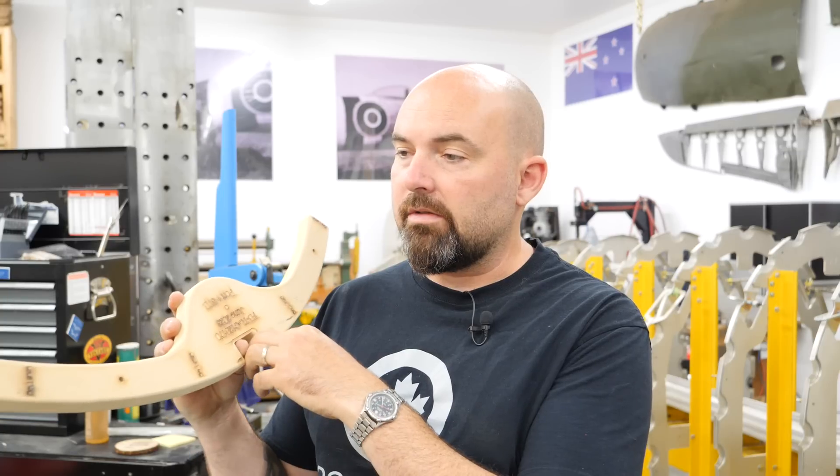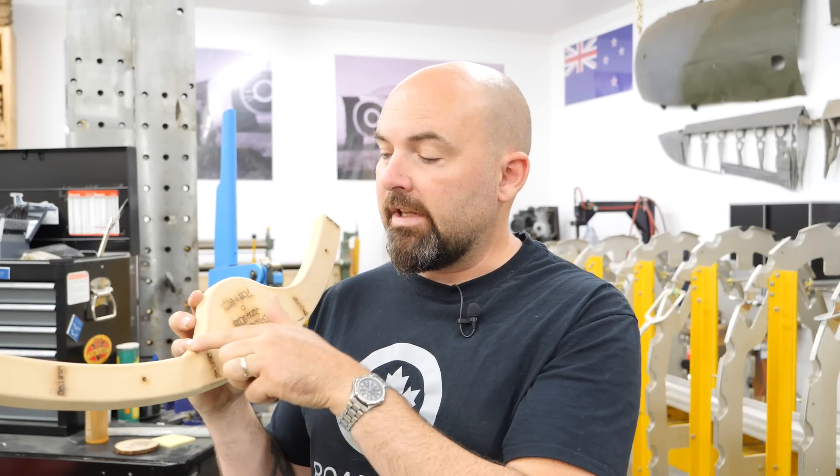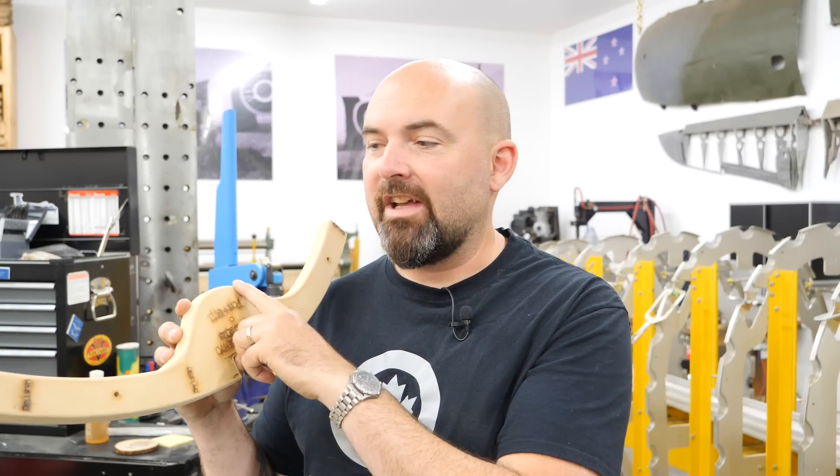In this case, because of the interesting shape, you end up with an outside shrink flange — pretty straightforward — then an inside stretch flange, but then when it comes back around you have a shrink flange too. So on this component it goes stretching, then shrink, shrink, a lot of shrink, and then stretch again. I'll show you that now.